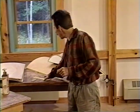Panel stability was our first point. Because PVAs have some flexibility, they can allow a panel under strong tension to spring back somewhat. And because of their higher shrinkage, as they dry, they can actually cause a panel that easily conforms to develop a tighter radius as they dry, called toe-in.